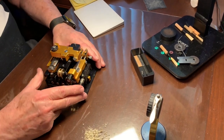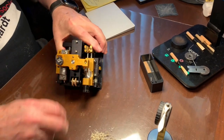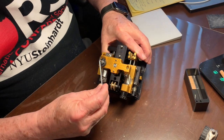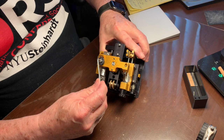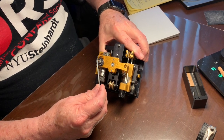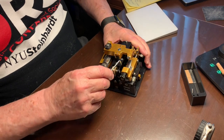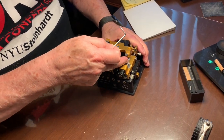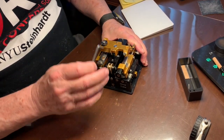The tip of the reed, if you want it thinner, you can turn this little knob right here. It's at 0.2 now. If I want it thinner, I'd put it just under 2. If I want it thicker, I put it back up here. Don't move this one very much at a time, because you could overreact and run metal to metal in here and damage one part of the knife, and you'd have to change it. So you don't want to take too much out.